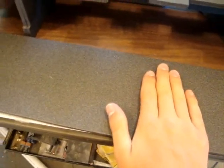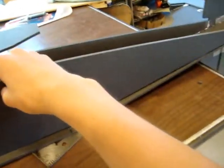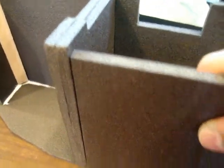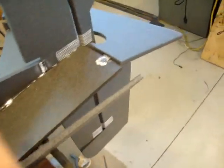rear section with this bottom skinning of the fuselage. So turn the fuselage sideways like this so you can see the bottom, and this piece, just glue it in like that. So what you're going to do is start by moving it up to the front like this, and start it in the front by gluing it to the landing gear block, and then just work your way down gluing it until you get all the way to the tail. I'll show you a step-by-step process here.